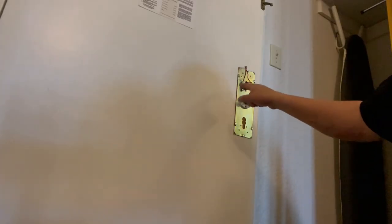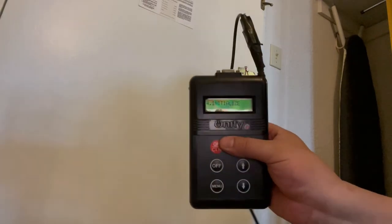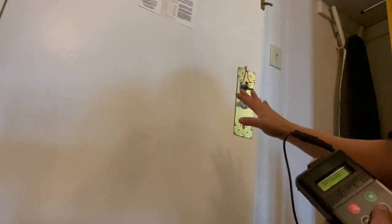So the next step is, once you connect it, do not screw anything yet, because you gotta take out the black box here and you gotta initialize the lock. You see right there, initialize. So what you do is you put the room number with the arrows here. In this case, room 247, I already initialized it. Okay, and now we're gonna give it a test, see if it works.